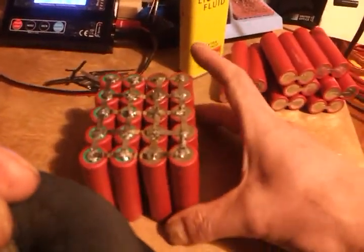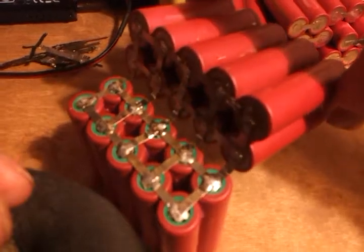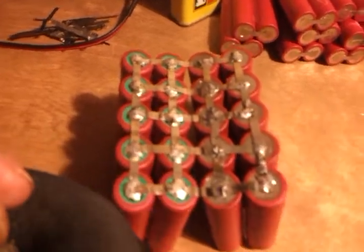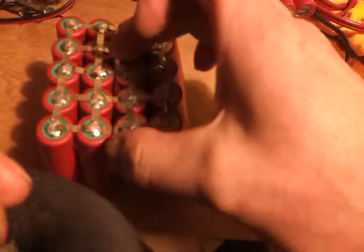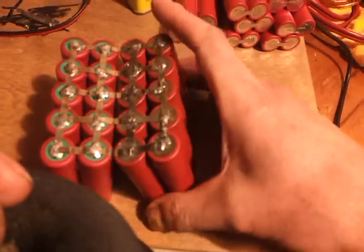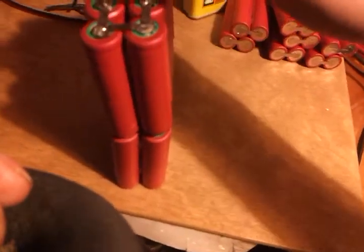If I take this I'll show you what I mean when I say we're going to fold it up like a concertina. When I put my balance charger leads in, I come down this strap in here, and I put one here and one here — just so it's not feeding from this end all the time. There's another feed point here so that it's working between a couple of cells from each balance charge point. I'm not sure if that's faulty logic but I like the idea so I did it.